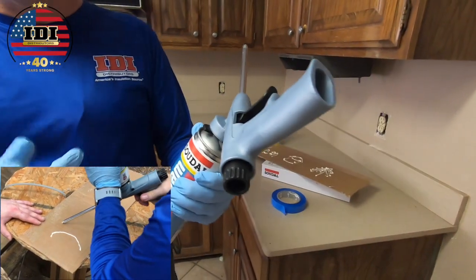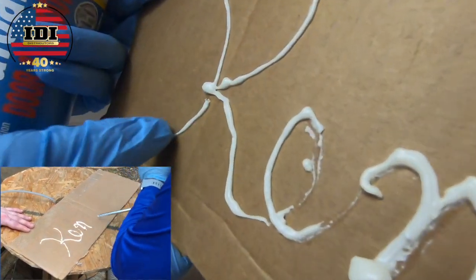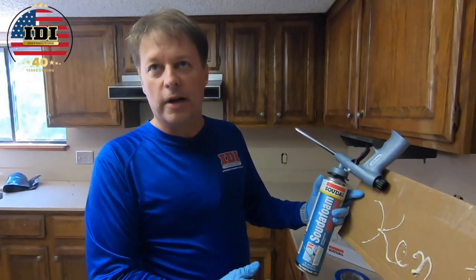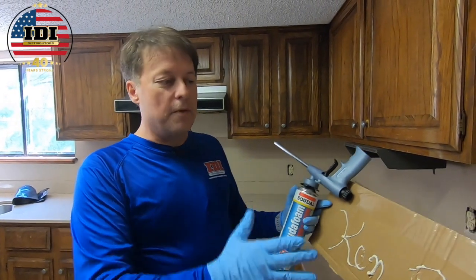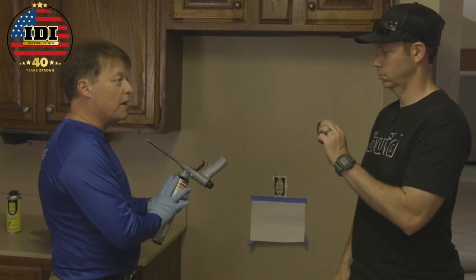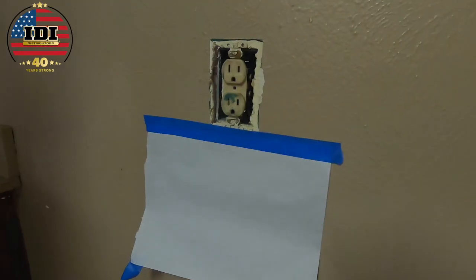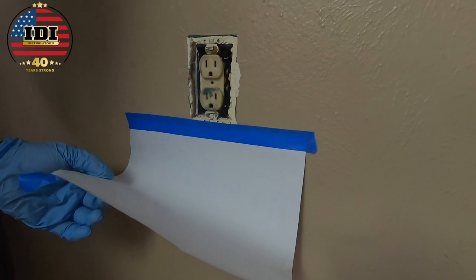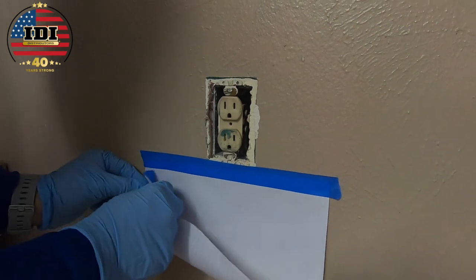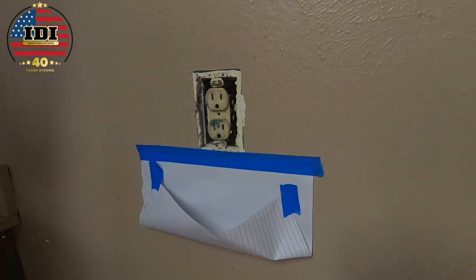This can will do a whole lot of outlets. Before going to a customer's house, I show them I can control the level of foam — drawing a picture so they understand I'm not trying to decorate everything. If it's my house, I'll go right to the wall, but otherwise I'll set up a capture tray. I take a sheet of notebook paper, tape it below the outlet, and come in one inch on each side for a nice capture area.